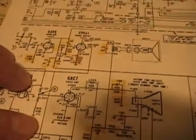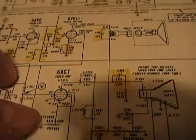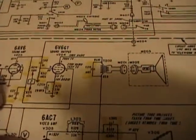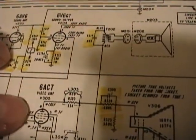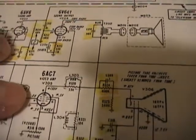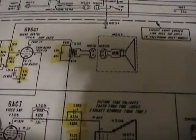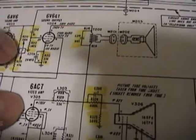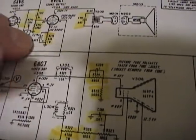So I thought I'd take a look at the contrast circuitry and see what's going on there. Turns out the contrast on this set's really simple. I call it a picture control. Just a potentiometer between ground and the cathode and one of the elements inside the tube. I think that might be the suppressor. Normally the contrast control controls gain in the IF stages or on the AGC bus, but this now just controls the gain on the final video amp. So I took out the potentiometer, and it does range from 0 to 1500 more or less.